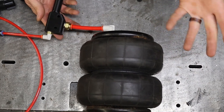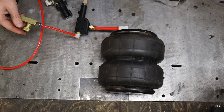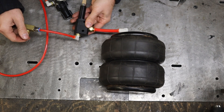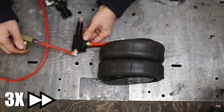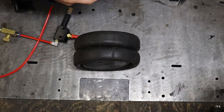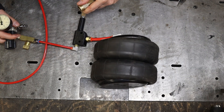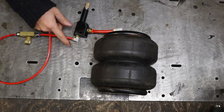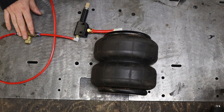The flow control is completely closed. I will gradually open it up and run air through the vacuum generator and see how it goes. A little bit more... a little bit more... it's working. A bit more pressure. Let's squeeze the pressure — increase flow, increase pressure. Three and a half inches. There's really a sweet spot: if you let too much air through, the vacuum will not be generated. So the flow controller is really important to play with.